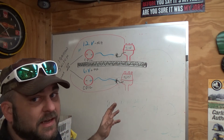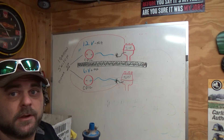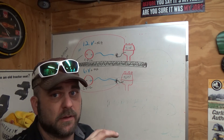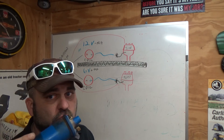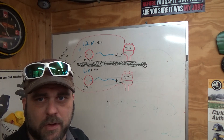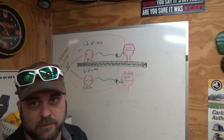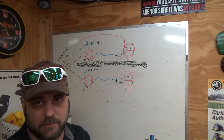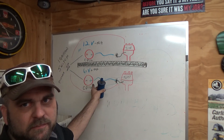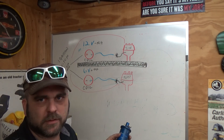As a side note, I see a lot of this when people have converted these or replaced the coil and put them on backwards — especially these little coils right here, wired up backwards. They work and they fire, but they don't build the right amount of amperage and the lifespan is greatly shortened. If you do not plug these in correctly, it's not going to kill you or blow up in your face. But if you short across them it can go off like a capacitor — so don't do that. Polarity, coil, ignition — get it right and your tractor goes to work. Thanks for watching.